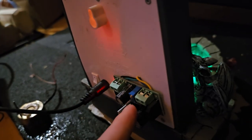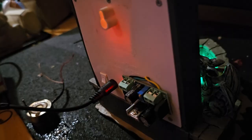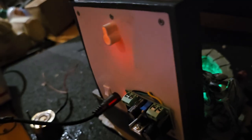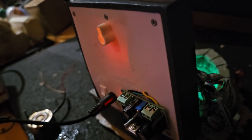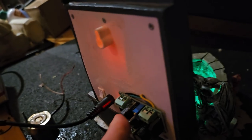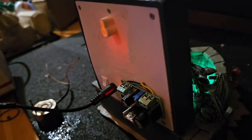On the back side, I've mounted this adapter. This is able to take the 12 volts AC, convert it to DC, and also step it down from 12 volt to 5 volt, so then it's able to regulate the voltage perfectly. I could even still plug in the 24 volt adapter if I wanted to, and it would be fine. This thing is able to regulate itself, so I think that's really foolproof, because if anyone stuck basically any adapter all the way up to 40 volt, this thing would actually regulate it back to 5 volt. So the Arduino and the lights are well protected and safe.